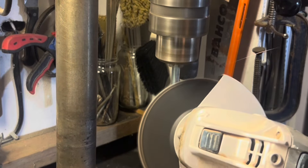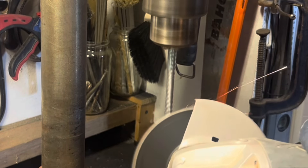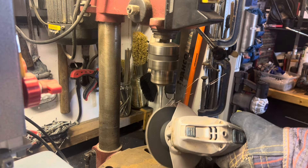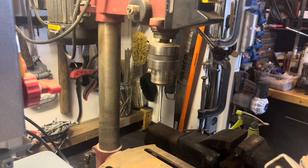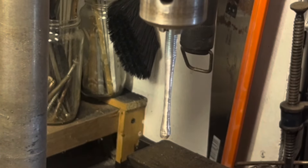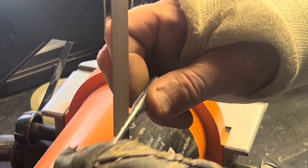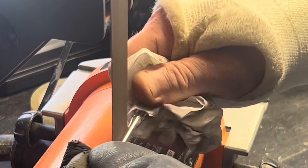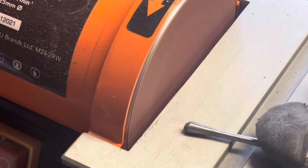What I wanted to do is make it thinner, but at the end I want it to be like a teardrop, so I can have a larger screwdriver end. I went a bit over the top — taking an angle off each side of the tip and made a bit of a mess of it. It got a bit hot. You can see the rough shape there, like a teardrop at the end and thinner in the middle. Then I flattened the end off on the disc sander.